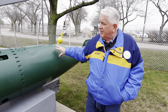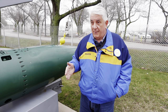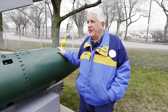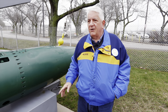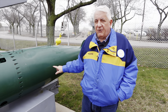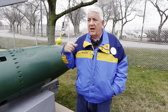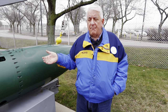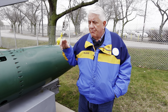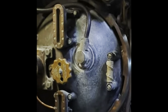So if you loaded this aboard COD and all of our systems were working — let's be frank, no museum submarine is capable of firing and programming a fish — we could load it into the tube and blow it out, but she ain't going anywhere, even if it was a perfectly usable weapon, because we can't program the gyro angle. We never got the modification. If COD had stayed in service a few more years and been modernized with the Guppy program, they would have replaced the breach doors with doors that had the interface for the electronic cable system.